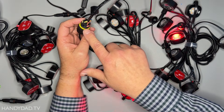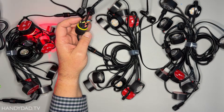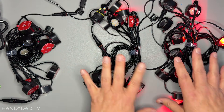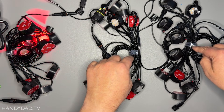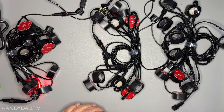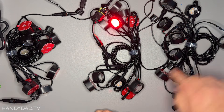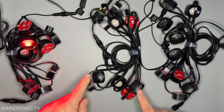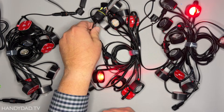The only difference is that the Pro came with the splicing kit. If you don't have the Pro version, you're going to have to splice the wires and make them watertight yourself. This is a one-time decision — if you want to create a Y, these lights will always be doing the same effect. You'll need to set them up for the longest string, because they don't have to be the same length — you could cut one of them, but you have to set it for the longest one. This is a permanent decision. If you're okay with it and you want them always doing the same thing, then you're fine. But you'll never be able to chase them from one side of your house to the other — they will always do the same effect. If you're okay with that, you can make a Y.